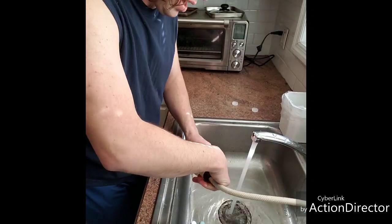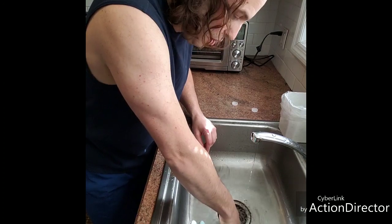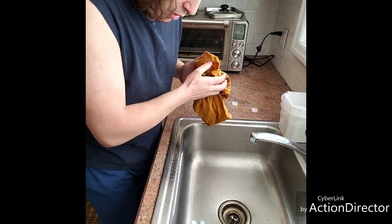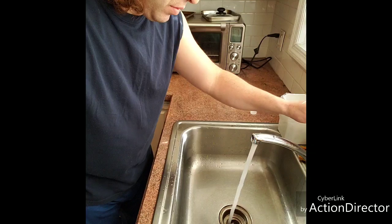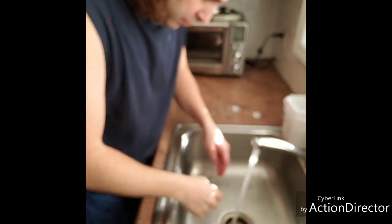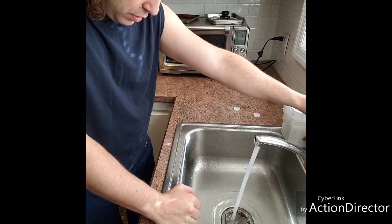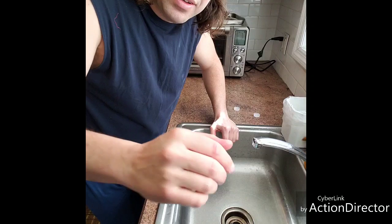You can just keep shooting it down the drain. This drain went from a complete stoppage to a functioning drain. That's working great now. So if you ever get in a pinch and you don't have any equipment or even just a simple plunger, just take a water bottle, fill it, invert it, and press down evenly on top and you'll most likely be able to flush out that drain.